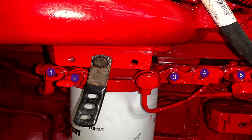Fitting number two and fitting number three have rubber covers — those are Schrader check fittings where you check pressure drop across that high pressure filter. You're allowed a maximum of 10 PSI drop, so if you have 185 going in, you have to have no less than 175 coming out. Fitting number four is where you put a Schrader check fitting to dump fuel, to check for air in the fuel and to simulate the system working. Fitting number five is where the return fuel line goes — this is low pressure fuel that the engine is done with and sends back to the tank.